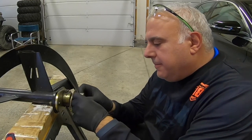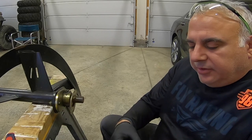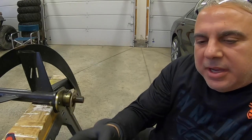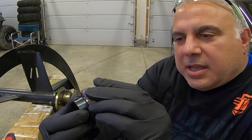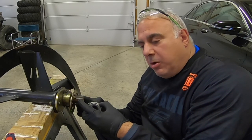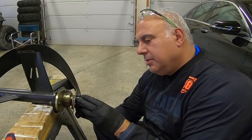I'm going to try to explain this the best I can. This is the bearing that I'm replacing — it spins very smoothly. This is a cam lock that holds the bearing in position. You can see the bearing has a little ridge in the inside race, and it's wide — it's made for this cam lock, which goes on that ridge and you spin it. It's not a circle, it's an oval, and when you spin this on the bearing, it tightens down on the shaft. It has a set screw with red Loctite on it. So the cam lock goes on first.